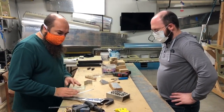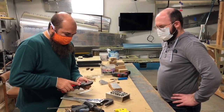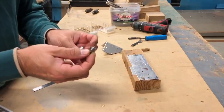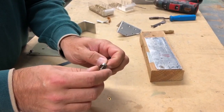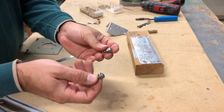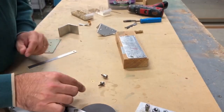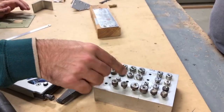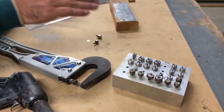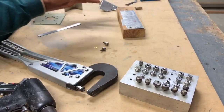So let's find the proper size dimple die, which is this one. Every manufacturer of dimple dies uses different numbers, but for Cleveland Tools the part number is 426-3. After a day of working with these you can tell by size — just make sure they're both dash-threes. The fours are physically much bigger. There are also substructure or tank dies which are the same size, but the depth of the dimple is different, so be careful not to use a substructure or tank die for a standard application.